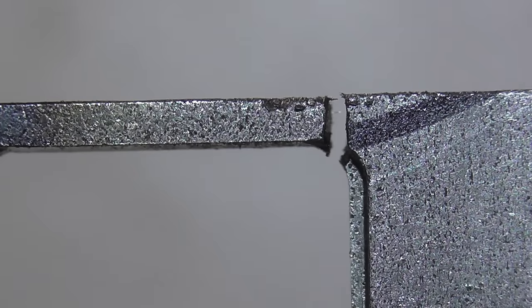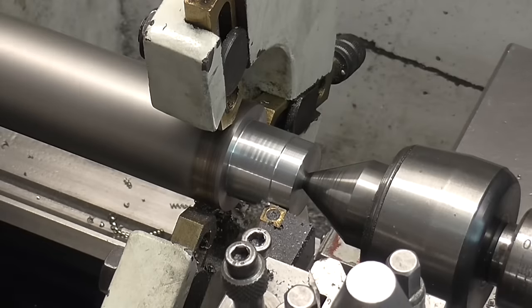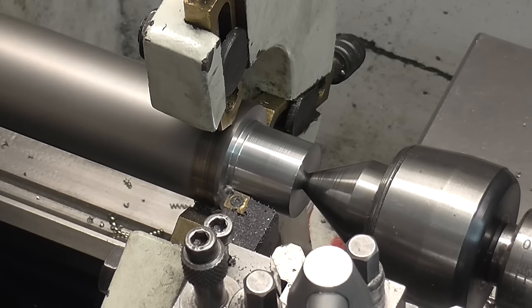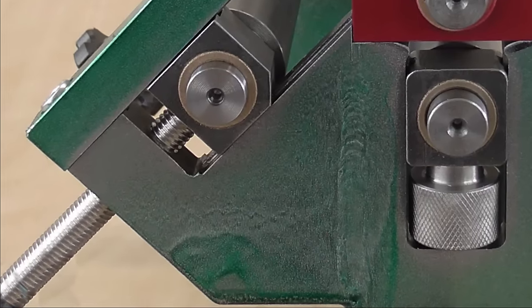I was slightly worried that the two uprights would spring apart when I cut the web, but they didn't seem to move at all. The third roller is made in the same way as the other two, except that it's slightly larger diameter. It will be adjusted with two threaded rods. I want to make some ergonomic hand wheels for them.